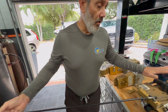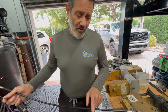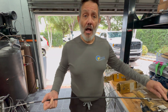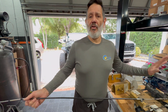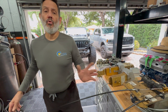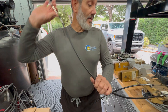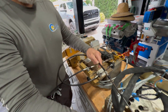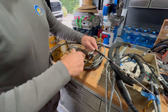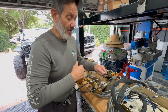Now if the boat is 12 years or more, I suggest you just replace the cables. The internal tolerances of that cable are no longer tight and it's never going to be the same. Sure, you can move it with one finger when it's disconnected because there's no resistance, but I can take this cable, bend it more than six inches, and it still moves — but how long do you think that cable is going to last like that? Maybe a year.